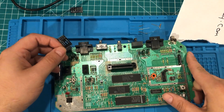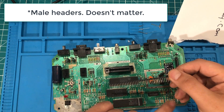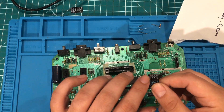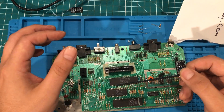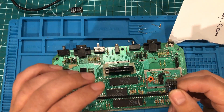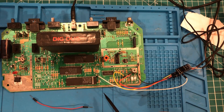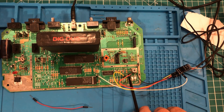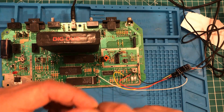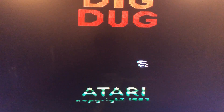My plan is to put the composite video mod board up here and tap into the ground plane right here. Since this is a yard sale find I don't know what I don't know, so I'm not 100% sure this thing will ever work. I'm going to attach female headers to the board and use Dupont wires to hook everything up temporarily, and just solder RCA cables right to here - so nothing will be permanently attached. I've made the basic connections: audio, video, five volts, and ground are all hooked up. The only thing left is to turn it on.